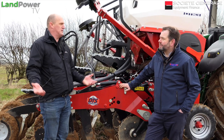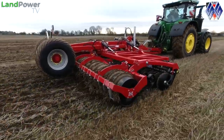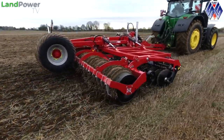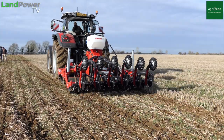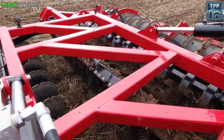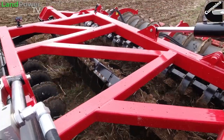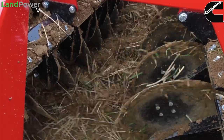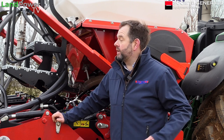Obviously you're here to impress a customer today. The farm that's invited us out is looking at a slight change to their system — going in and doing minimal surface disturbance initially with the LDS-type subsoiler. Then they're incorporating farmyard manure and chicken manure, so they want to do a sort of top mix of soil and manure. But they also want a machine that can be dual-purpose and do a low-depth cultivation, moving enough of the surface to enable green chip to get volunteers going, get the blackgrass going, and just start that cultivation process ahead of the next pass or the drill.